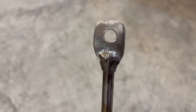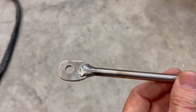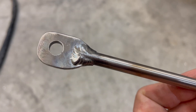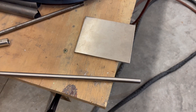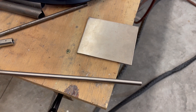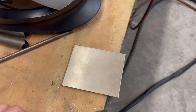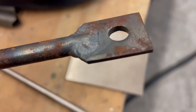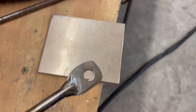I don't know if any of you guessed it, but let's get it out of the bag — this is titanium. I'm trying my first hand at titanium fabricating, and I enjoy welding; it's actually pretty cool. It seems to penetrate well and do what it needs to. To make that steering rod, I started with a piece of 5/16 straight round titanium rod and a piece of plate, and basically cut out the square like they did for the factory setup — welded around, works really well.